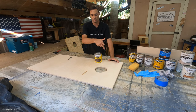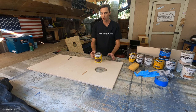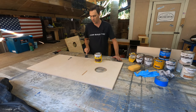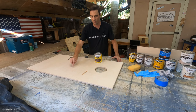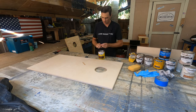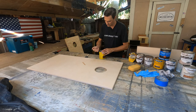You want to stir it around. If you shake the can, you're going to make bubbles, and when you put your brush in there you're going to transfer those bubbles onto your top. You'll have these little bubbles everywhere and it will drive you nuts. So the first thing you want to do is open the can and stir it.